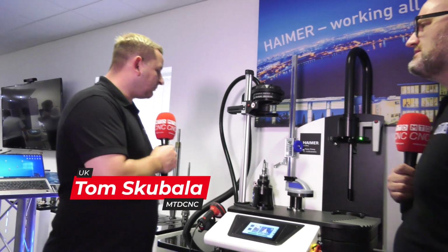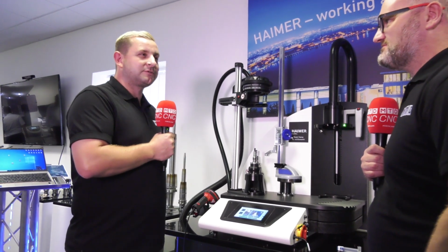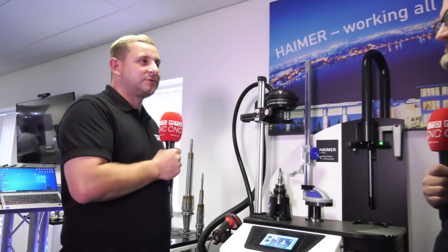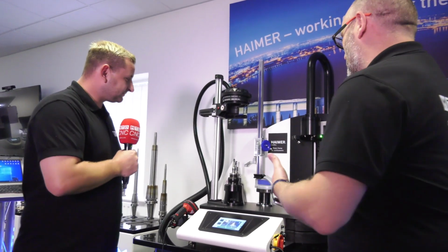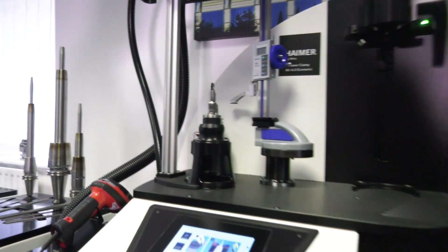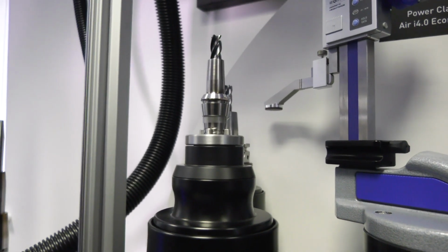Yeah, what really intrigued me about this machine is the heat shrinking collets, for live tool and lathes, and that you can set the height. So as soon as you need it in the machine, the tool's already set. Yeah, we've all set collets before, haven't we? And it's the advantages of shrink. We're talking about concentricity, improved tool life, improved surface finish, aren't we?